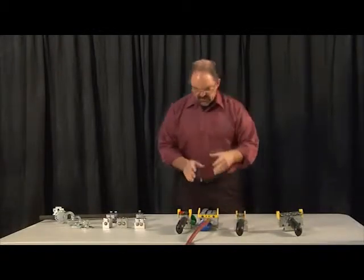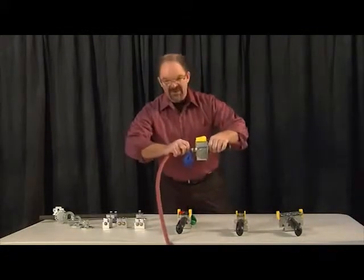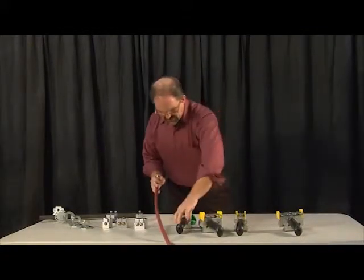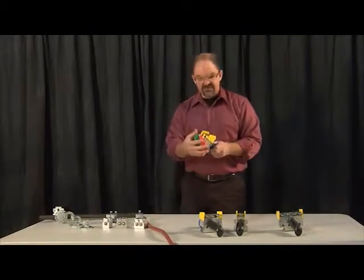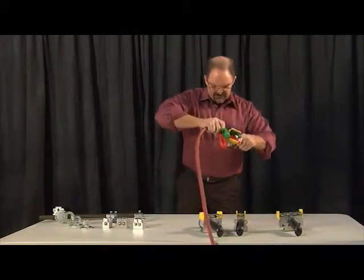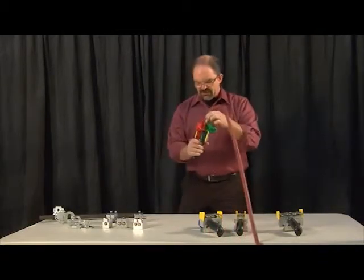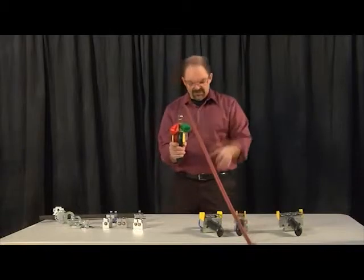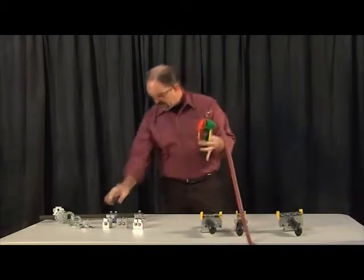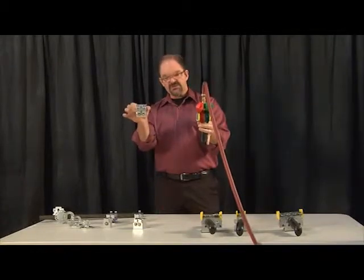Okay, so I just showed you the rear exhausting 3-port valve. Now I'm going to show you the 2-button pallet valve. On this one I have 2 balloons. We're going to apply air to our incoming, and I've color coordinated the balloons to the levers. When I press this one, it's going to behave as both the single and the double. This is a double block, which is this one right here. This is the handle that I'm using, and this is the block.